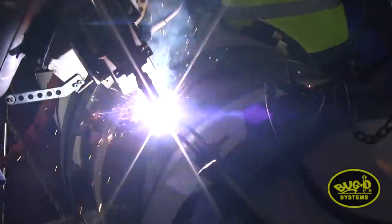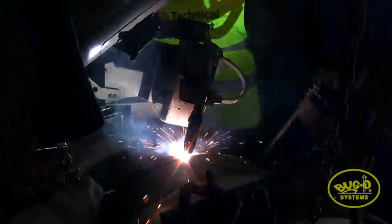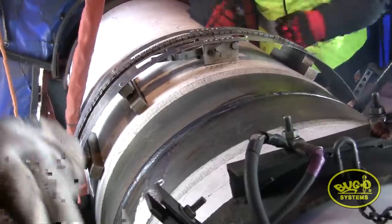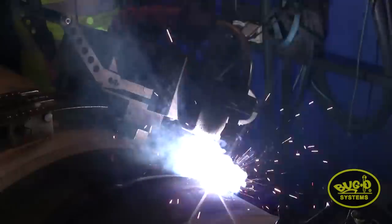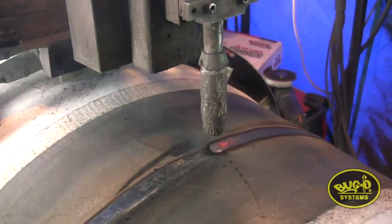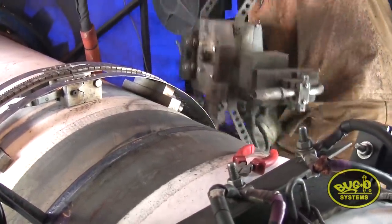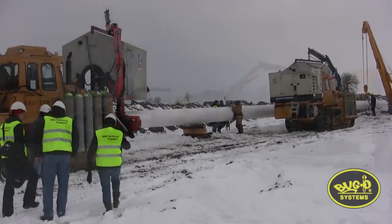Providing a consistent ground for the welding circuit on a pipeline can be a challenge. The typical ground clamp placed on the edge of a plate or bolted to a weld fixture is not practical on a pipeline with no edges available to the welding shack. Further, it is critical that the coating applied to the outside of the pipe not be damaged, as any cuts or scrapes on the surface could cause corrosion. In order to provide this welding ground, a system of grounding pins or plates on lever arms is used. One pin or plate is positioned in the weld joint itself as the weld is performed on the opposite side of the pipe. As this weld is completed, the ground pin or plate is lifted and the one on the opposite side is lowered into the weld joint. In this manner, if an arc strike occurs as the ground is placed and lifted, the arc strike is welded out as the process passes over the former location of the ground. This entire grounding assembly is attached to the inside roof of the shack by a pair of chains, and is removed and repositioned automatically as the shack is lifted and lowered onto the pipe.